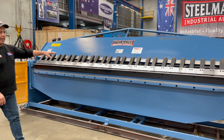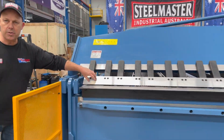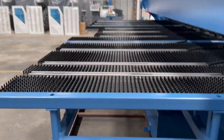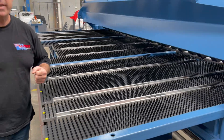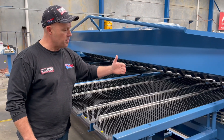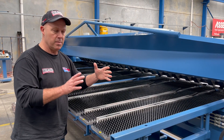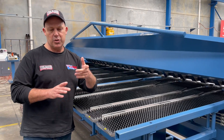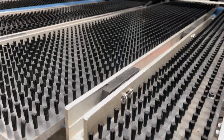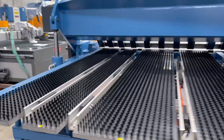The folding beam is actually clamped. Coming around the back here — all these fingers are hardened and ground and also made to a tensile strength. This is the impressive bit: this is the NC2 programmable back gauge positioning. It has a brush table, as you can see here, and a two-stage back gauge positioning. I believe this one goes to about 1,000 or 1,200mm. We can actually customise the back gauge positioning to suit your requirements. Nice roller brush table all the way around, so it won't damage your stainless steel, your aluminium, or any of those.